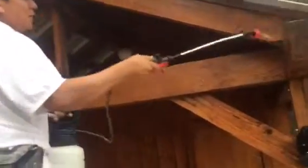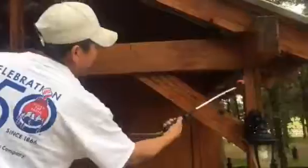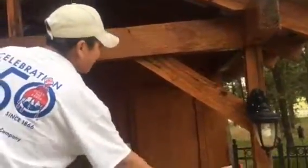See here where this stain is coming off already? You can see it up here where that stain is coming off. A lot of this stain will come off — maybe not 100% of it, but a lot of it will come off by putting this on here. You pretty much have to treat most cedar woods with bleach prior to power washing, because you've got to get a lot of dirt, dust, mold, and things that would prevent the new stain from going on evenly. So here we are in the danger zone, showing you the details of this bleach just eating away at the existing stain right now.